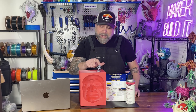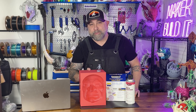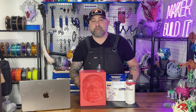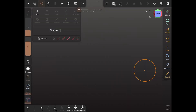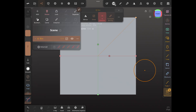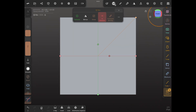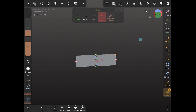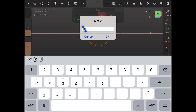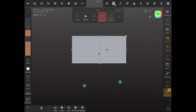The first thing I'm going to show you is how to take your 3D model and make your 3D mold. Let's open up Nomad Sculpt — you can do this in any 3D modeling application you have. We're going to delete our sphere and add a box, making it big enough to fit our mask in, pretty much the size of our print bed: 256 by 256. We're going to make it 128 millimeters tall, which is your Z axis on your printer.